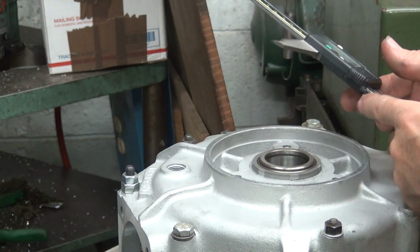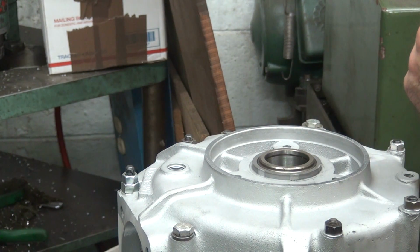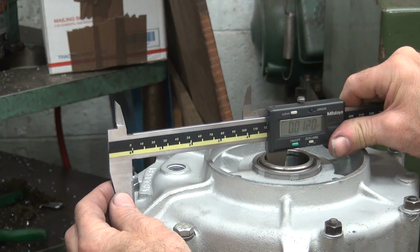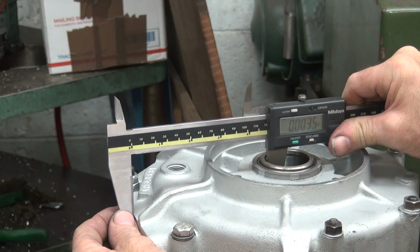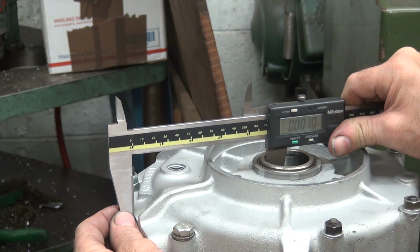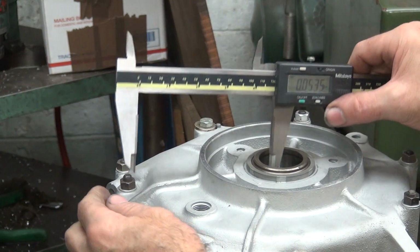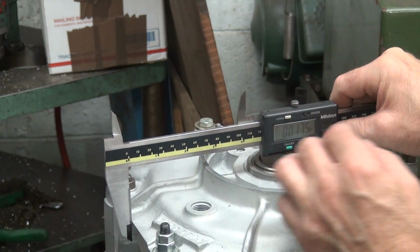Hitting against something probably back here on the caliper. Oop. That's a good way to break your carbide tip, right like that. Don't bang them on steel like that. Just right, we got to zero, but it's hard to get there. It was a two for a long time. I go over here and it's having the same problem. I'm hitting right here.